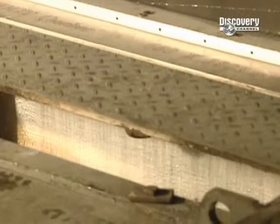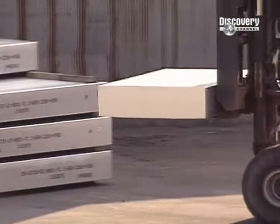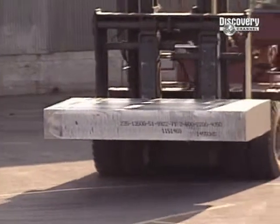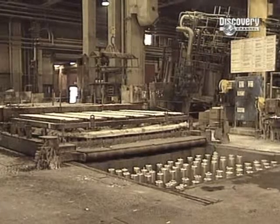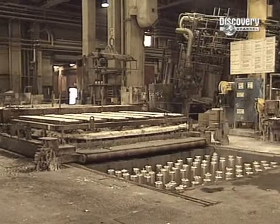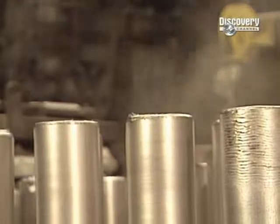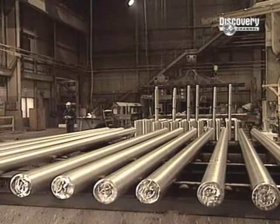The cooling of aluminium pieces is accelerated by water sprays. The large rectangular ingots, which can weigh up to 25 tons, will head for hot rolling, eventually leading to products such as aluminium foil. 5 tons of bauxite have produced 2 tons of alumina, which in turn produces 1 ton of aluminium. This particular plant produces 200,000 tons a year. It's metalwork on a giant scale and feeds the ever-ravenous world with aluminium.